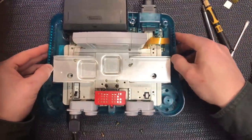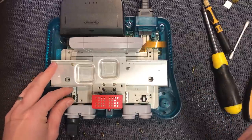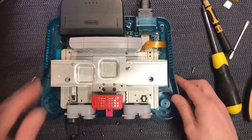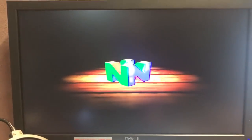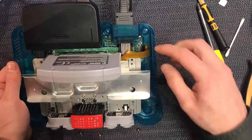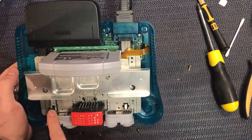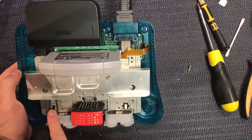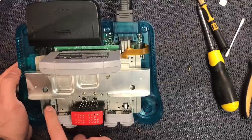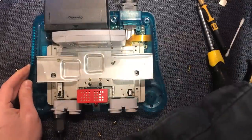We'll plug in our composite as well. Let's give this thing a shot — my monitor is ready to roll and we're on. Composite still works and looks as crap as it always does. Something else to note on these boards is that there's actually a little status LED down there. That gives us a bit of a self-diagnostic mode — it flashes once, I believe, and then if there's a problem it keeps flashing. Once is a good sign.